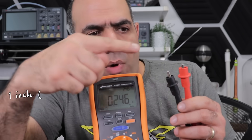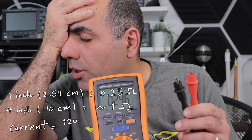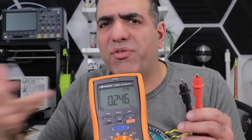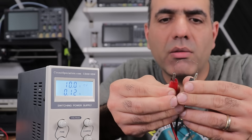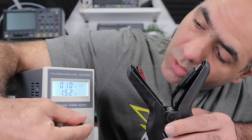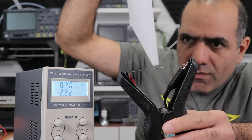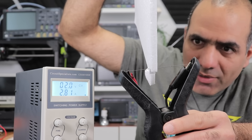You can make a fuse out of these wires. Okay, let's not lose focus — first I'll make a foam cutter, then I'll make a fuse. This wire is around 250 milliohms per inch, so over 4 inches and 120 volts it would draw 120 amps. I just need it to be warm enough to cut foam. I connect it to a 10-volt supply and raise the voltage if needed. Starting at 1 volt — a bit sticky. 2 volts — starts to smoke. It is cutting!